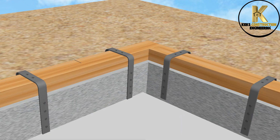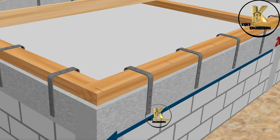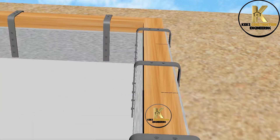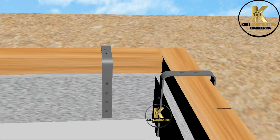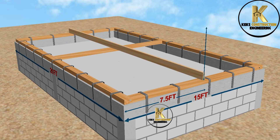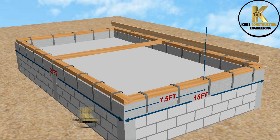It's advisable to install straps after the wall plate frame has been properly set out and marked to avoid rework, as they can obstruct measurement and rafter mark positions. Now, let's first of all remove the already marked ridge board from this point so that we can determine and install the rise of this gable roof accurately.